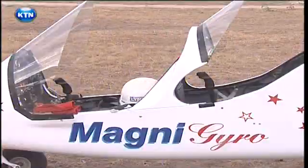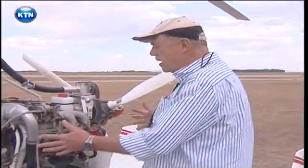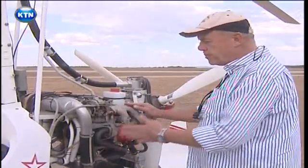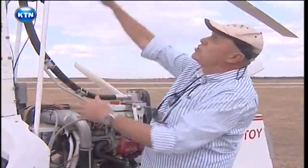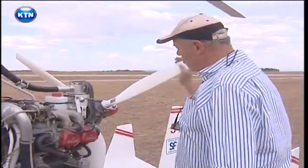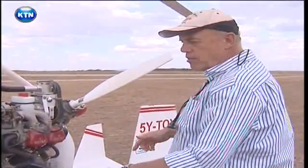It's not the materials that are unique — it's the actual flying machine and the way it flies. The owner explains: the engine has no covers, making it very easy to inspect. Every time you go flying, you want to check the spark plug connections, the carburetors, and the electrics. You also check the controls that control the rotors and inspect the propeller blades. That covers the general inspection of this area.